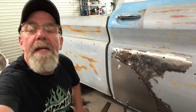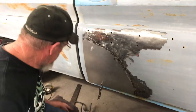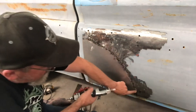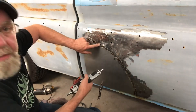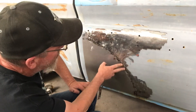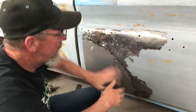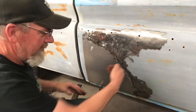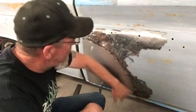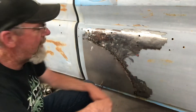It's come out all right. I got a couple of tacks, then cut a little bit, put another tack, cut a little bit more, going back and forth. But it keeps wanting to blow through in spots, so I'm having to take it really, really slow. I've got a low spot through here now instead of a high spot. I'll do a few tacks, let it cool down, come back and do a few more tacks.